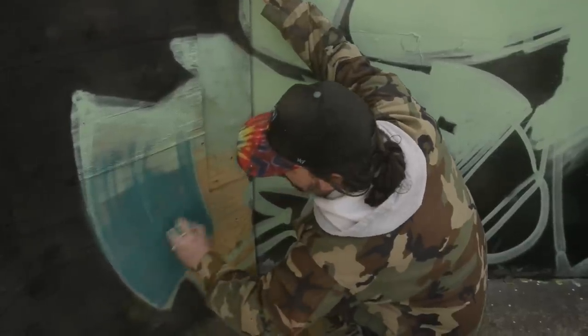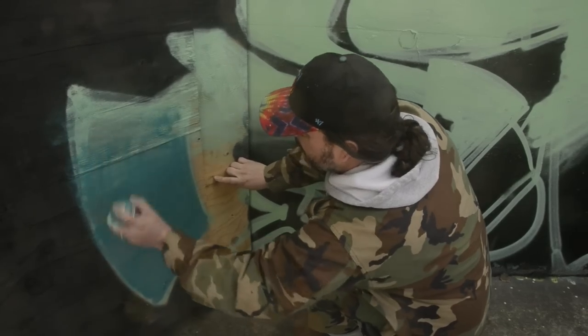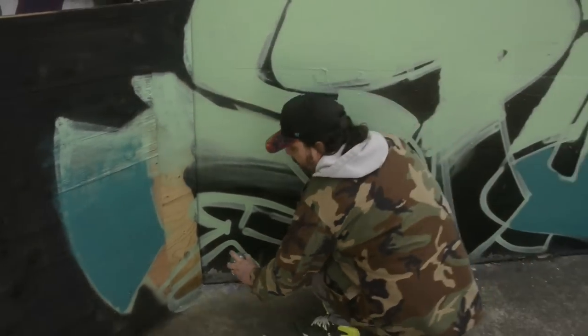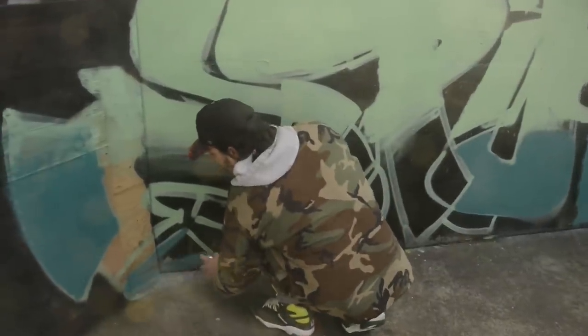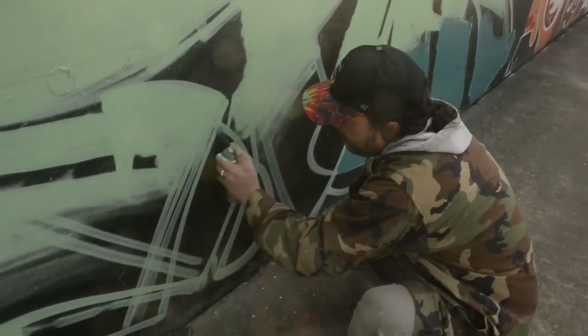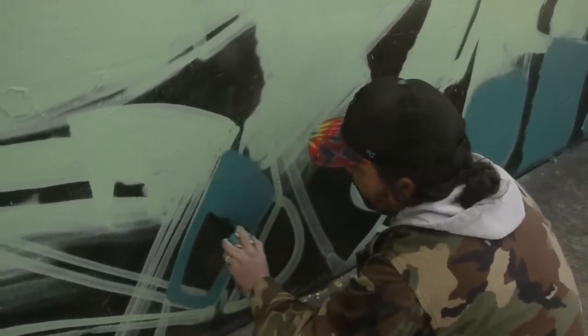I gotta say, this was raw plywood. The flame blue definitely covers the raw plywood nicely, although I would recommend buffing whatever you're going to paint first. Nevertheless, in a pinch, it appears you can get by without it, but you will use more paint, so keep that in mind.